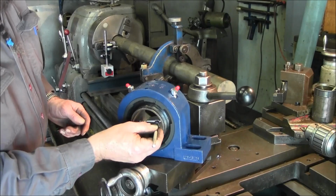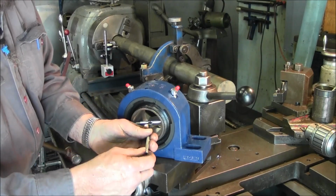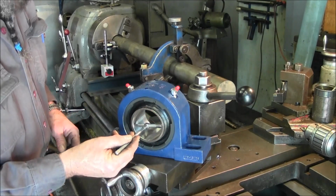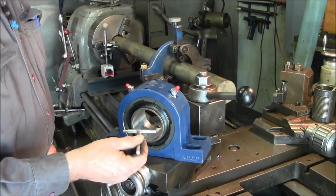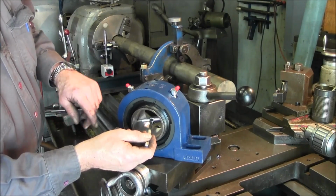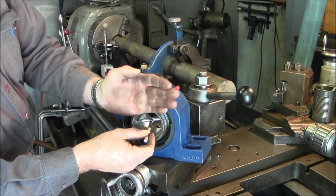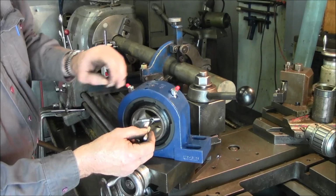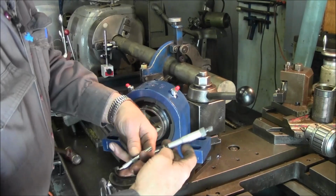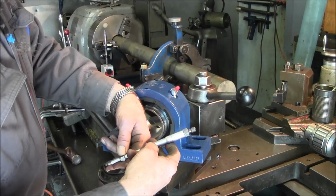Now, because you can travel one way or the other way, back and forth on your slides, I like to pick the middle with them slightly angled so that they're longer than the bore. That right there is almost 100 thousandths longer. This is close to a 3-inch. Now, when you put the snap gauges in the bore to take your reading, I try to keep this one stationary, and I pull on the handle, the one on the back side, past that one. And that is the position you measure, and you measure once. You don't put the thing back in because you can take a chance on closing it tighter than it actually is.